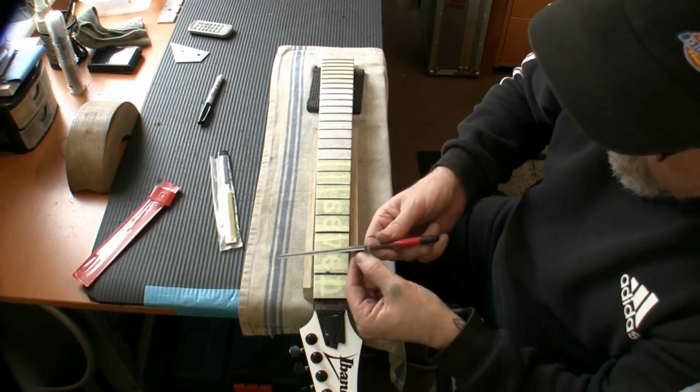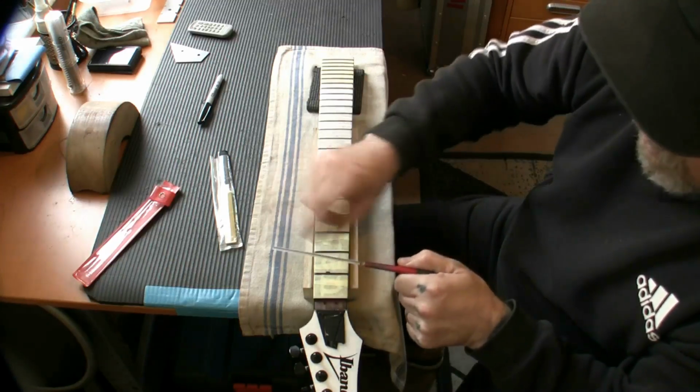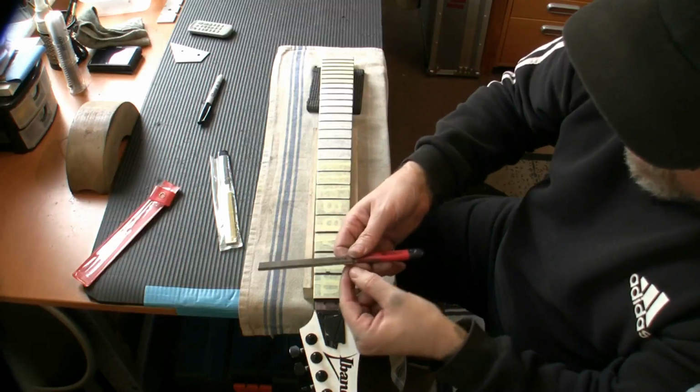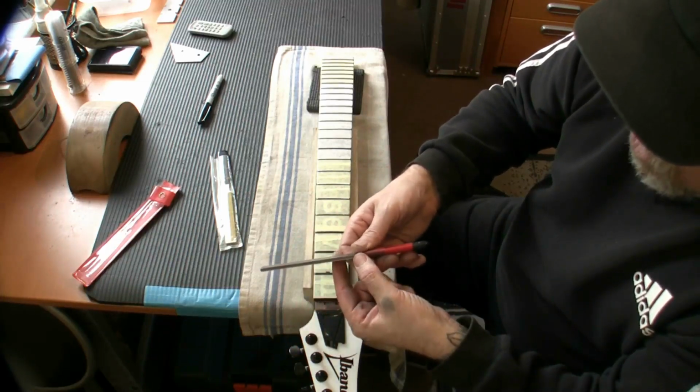It's a diamond file, so it's got diamond filings in there. Cuts really smoothly. It has a long cut closest to you and a short cut closest to me. The short cut's a steep angle, the long cut at the bottom is a narrow angle. When you turn it 180, it's totally opposite. A sharp short cut on the bottom now, and a long slim, shallow cut on the top.